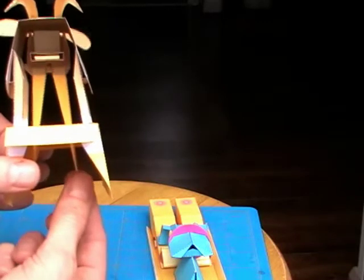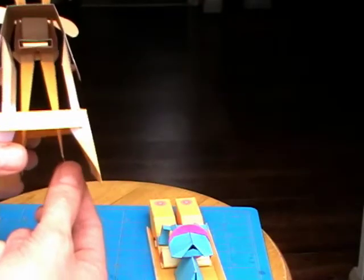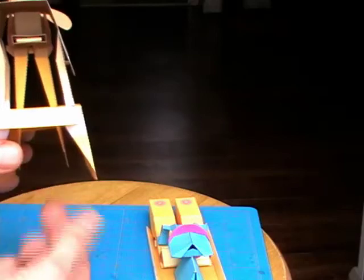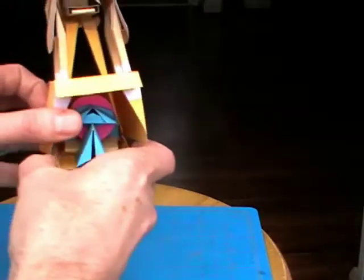Both pushrods work like that. It doesn't matter if the pushrod goes down — the one on one side of the rocker plate can go down and it doesn't touch the neck. Once it's pressing up, it lifts the neck upwards. One side pushes that pushrod, one side pushes the other. The bottom end of those pushrods are the bits connected onto the rocker plate.